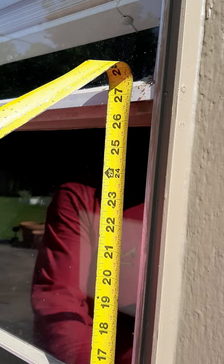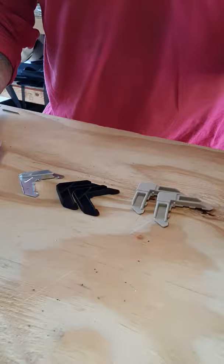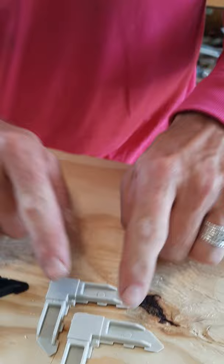All right, that's easy enough. We're going to head over to the shop and give this a cut. Now inside the shop, I want to show you the different corners used for building bug screens. If you go down to the big store and buy the little bug screen kit, chances are you're going to get these exterior plastic corners in a series of colors — brown, tan, white. In this case it's tan. Just keep in mind, if you decide to use this style of corner, when you go to make your cuts subtract an inch and a half, because each one of these are three quarters of an inch.